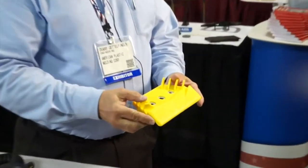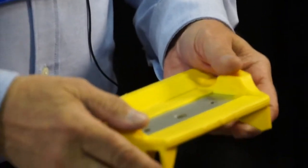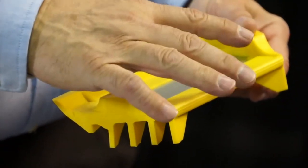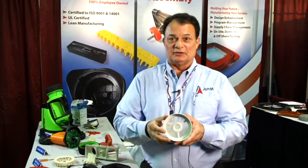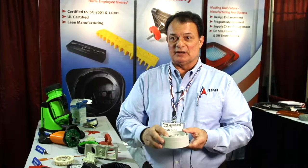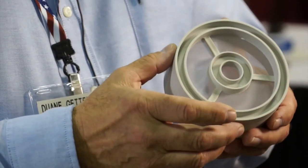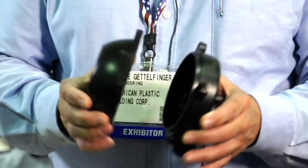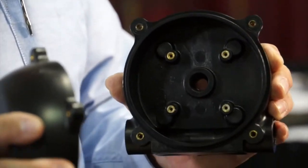The difference between a horizontal and vertical mold machine is that you are capable of doing insert molding, similar to this part where we have a metal plate inserted in the mold tool horizontally on a rotary table into the mold machine, to another position where it would be injection molded from the side. This particular part is a filtration canister where we've inserted a nylon film inside the mold tool, and then injection mold another nylon material around it. Here is another example of insert molding where we place brass inserts inside the mold tool, then close the mold and open it back up with all the inserts inside.